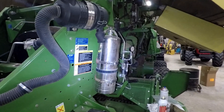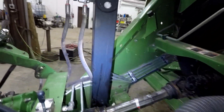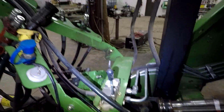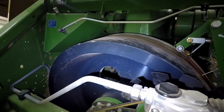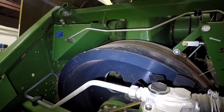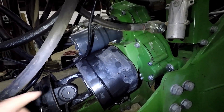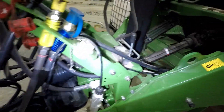There is one of your fire extinguisher cans to put it to size. These things are extremely heavy and take a lot of power. So one thing they've actually done is they've gone to a hydraulic jack — no more cranking anymore. The flywheel is like 2400 pounds to get it rolling. It'll kill a 200 horsepower tractor just trying to get it rolling over. So what they do is put a hydraulic motor right here, going into this gearbox, and it is splined right into our driveline. So it's actually going to use a hydraulic startup to get it rolling.